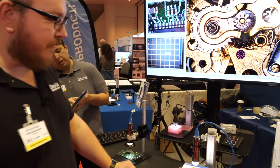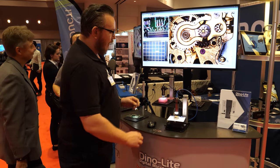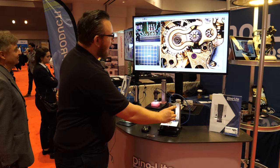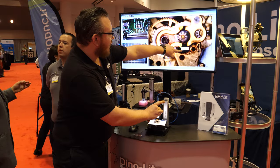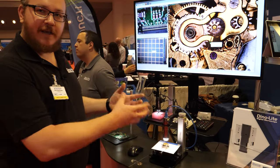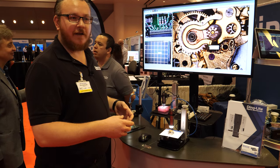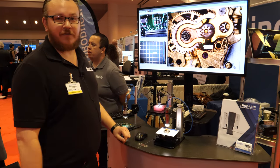What's so special about this one — why is it $1,400? This model is USB 3.0, it's 5 megapixels, and it will auto-calibrate itself if you're doing measurements. So if I put down a measurement and I turn the dial, it's going to automatically input the correct scale into the software. To do a measurement, all I have to do is get it in focus and measure. Instead of putting down a calibration standard, doing a calibration, and redoing that every time I change magnification, I just get it in focus and measure away.